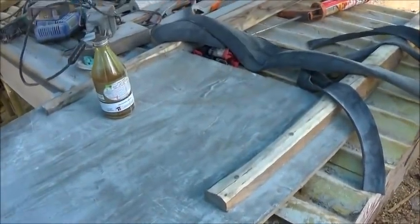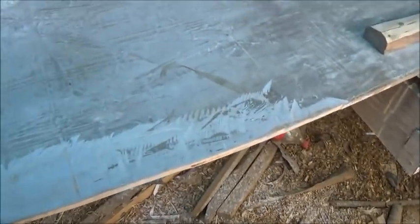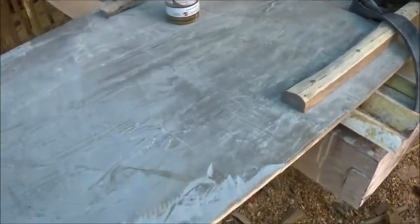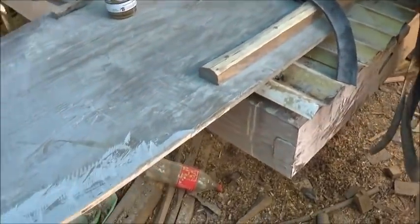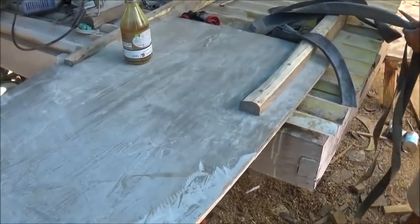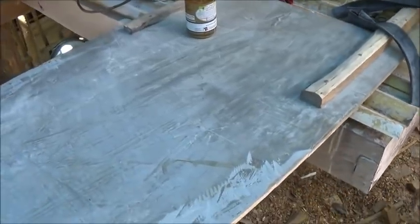We're going to use this cement, and even though we don't have stainless steel staples, which I would prefer, we're going to staple it, because it's easier to form it to this if we use staples. The staples by themselves would never hold this on here, because I think they would cut the rubber. But they will hold it in place exactly where it needs to be while that cement glue dries, and they'll help it stay where it needs to stay even after the glue dries.